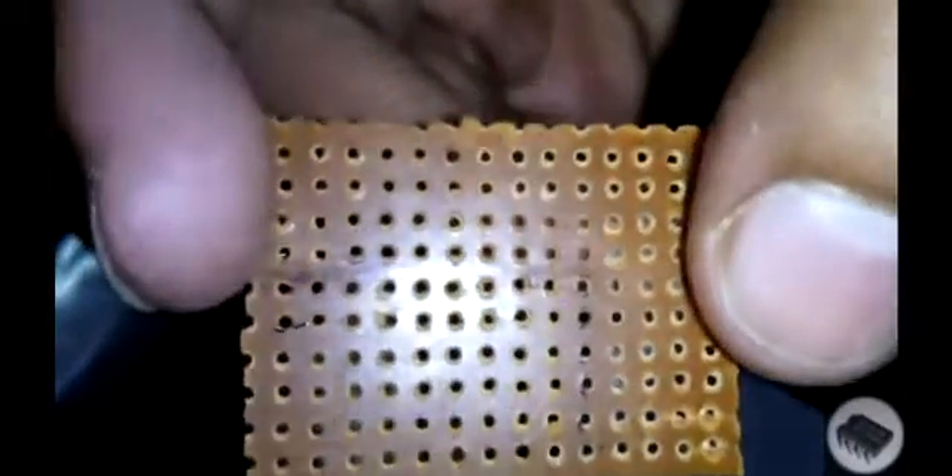I think it is clear that the circuit needs to fit from here to here only. So let's solder our equipment on the board. First of all, placing the IC. I have placed my IC towards the extreme left corner, with the face or head on this side. Then I have placed a condenser whose positive wire will be connected to the first terminal of the IC. Let me show you — this is the first terminal of the IC, here will be connected to the condenser positive terminal, and I have soldered that.